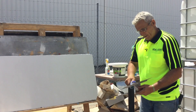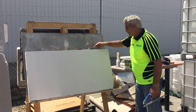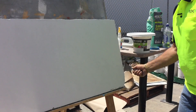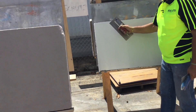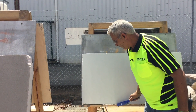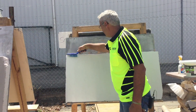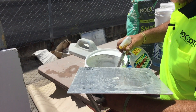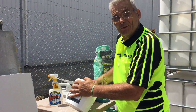Step 4 is the second application of Smooth Set. It is important to ensure that your tools are clean and free from dirt and dust at this stage, as this is your final coat. Scrape away any unnecessary product, give the walls a light scrape down and a brush off. This removes any little contaminants, because any fine gritty sand will put a scratch in it that is very hard to get rid of. On the second coat, I generally like it a little bit wetter to apply — it makes it easier to finish. If you have it too stiff, all you get is a sore arm.